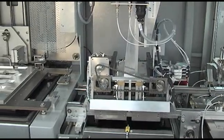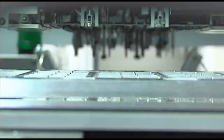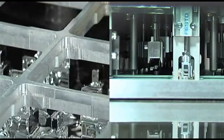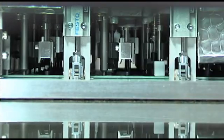From the preheat, the PCB moves onto the stamp soldering station where it is again held perfectly flat. The volumetric stamps lift out of the solder pot through the contour plate and finally to the leads. The entire process takes place in a controlled nitrogen atmosphere.